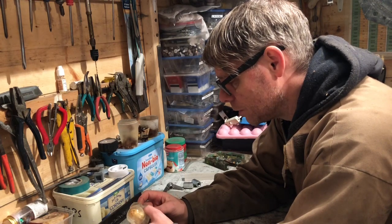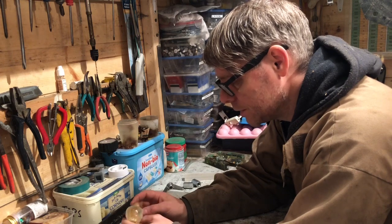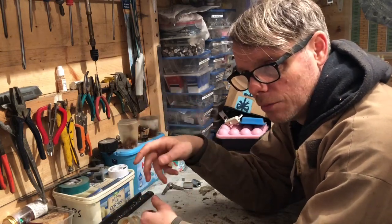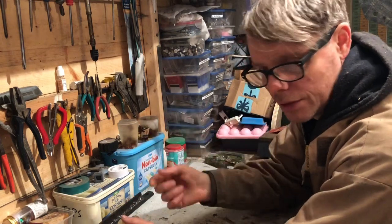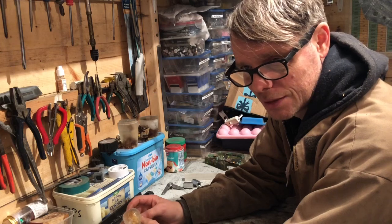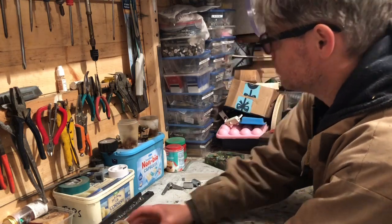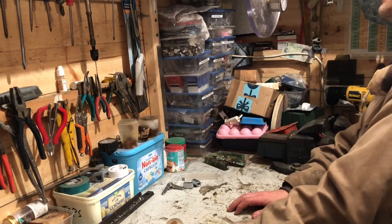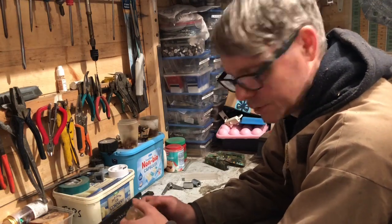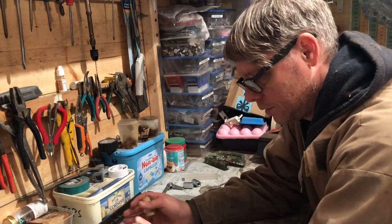So I thought, what about a pressure pot we use for cooking? I've got one of them. But what you'll find is the original lid that comes with the pressure pot for cooking doesn't form an airtight seal around the lip, at least the one I've got. So I've had to improve it, and I wanted it stronger — I didn't want to explode the thing. In the northeast of England it gets pretty cold, and you need a good temperature for the resin to cast. So I thought, I'm going to make a pressure pot with central heating.